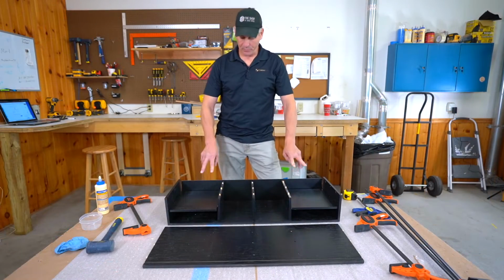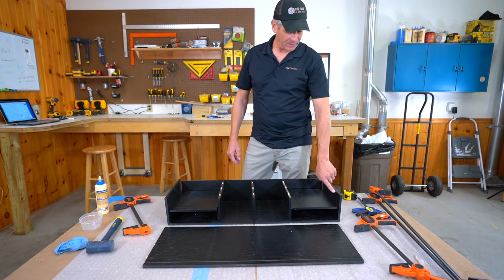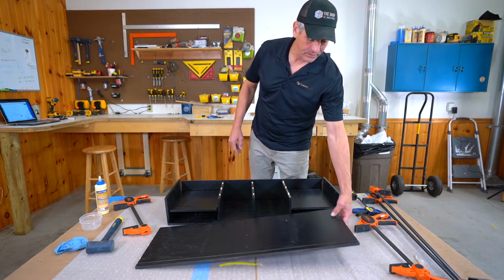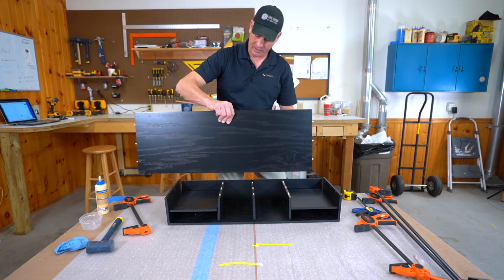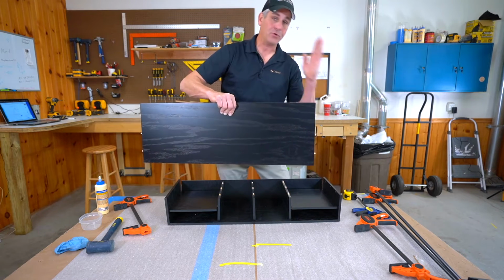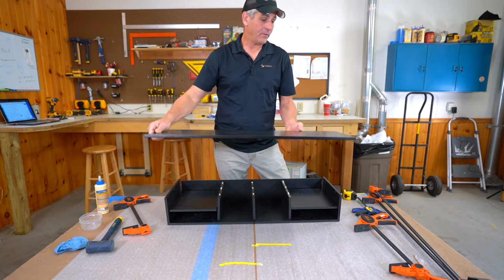Okay, as we were putting this back in, I want to call your attention to a mistake I made. I'm not afraid to admit mistakes. We had the pegs inserted here with the long part sticking out. Much easier if you put the long part in the top panel, because you're going to have to spread these outer panels out and then wedge this in to have these 3 pegs hit here and these 3 in there, and then we can close the gap. If you have the big part sticking out, you're really going to spread those panels. Doesn't work.